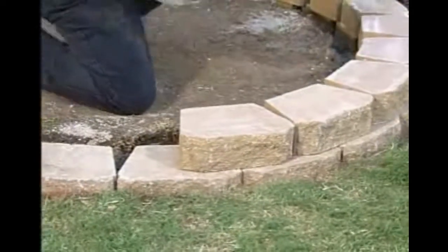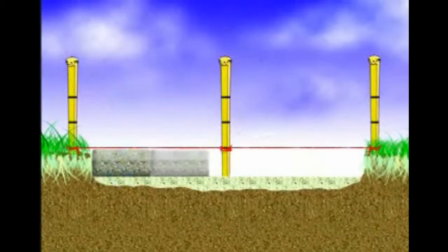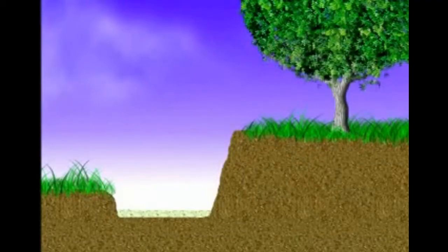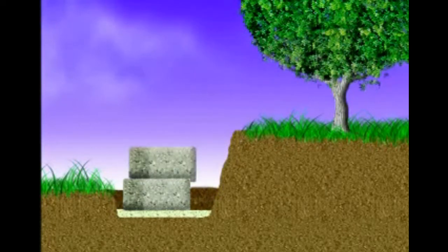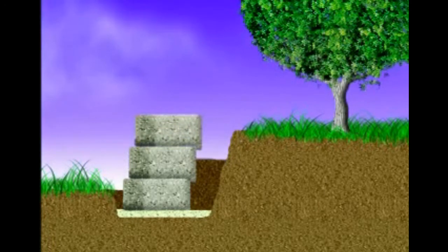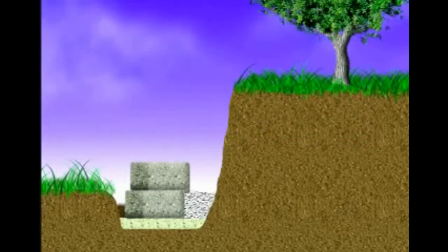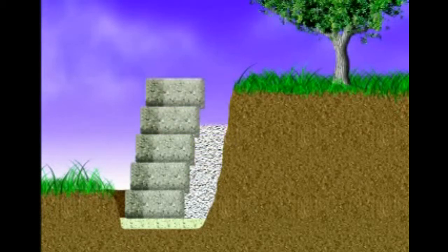As you place a stone on top of a course, pull it forward to secure it in place. When building your wall, you may need to lay partial stones to complete a course — if so, mark the length you need on the stone. To finish your project, backfill the wall with native soil and compact in 4-inch increments. For small walls, use the soil you excavated from the trench. For tall walls, use a clean granular backfill like fine gravel or pea gravel at about 6 inches thickness to assist in draining.